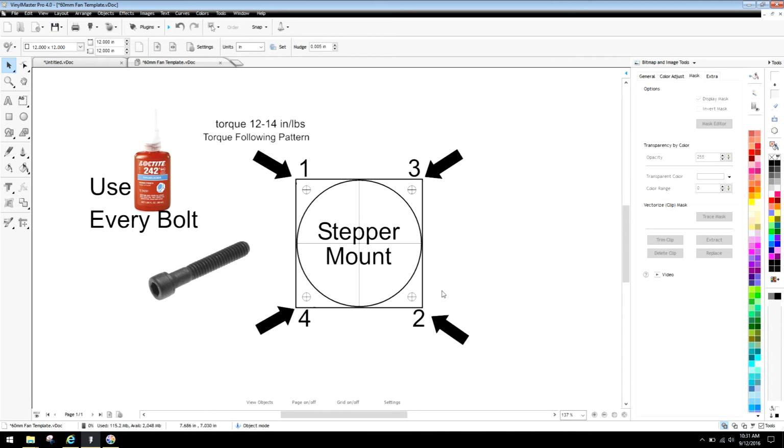If you use that method, you're really doing your best to balance out all of that torque and stress on whatever you're mounting. Okay, whether it be assembling the chassis, we never want to pull the chassis out. A lot of guys I've seen, believe it or not, mounting their spindle mounts after tramming them, and they use too much torque on the spindle mount, and all of a sudden, whatever they've used as shim stock behind there, they've pulled it out. And again, you're only dealing with thousandths usually. So if you snug it down too much, you're going to knock her out of calibration. You've got to do the whole thing over again. It's a pain in the ass, to put it mildly.